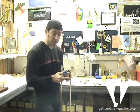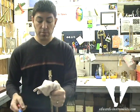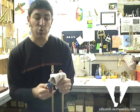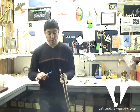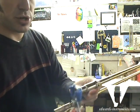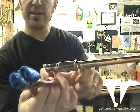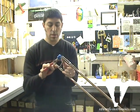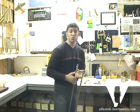If you don't have tape and you have to get it loose, you can use a cloth put over the jaws so they don't mar the slide. But tape works a lot better — I have used the cloth method at various shows. When I put the jaws on the slide, I make sure not to get the jaws anywhere close to the sensitive areas or else you could risk marring that. I just get it right on the knurling, then tighten down, twist, and it'll generally loosen up.